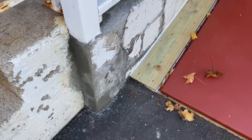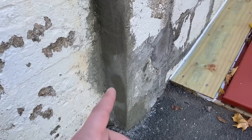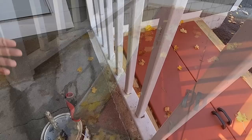It is the next day and this is how the concrete has cured up. I was doing some research on this type of concrete and it says you should wait — they recommend seven days before painting with latex and 28 days to paint with oil base. I'm going to be using latex concrete paint here, so I'm going to wait a week. Luckily I can do that; I have plenty of other projects to jump onto. And with the magic of video, you don't have to wait that long. One week later, let's get this concrete painted.